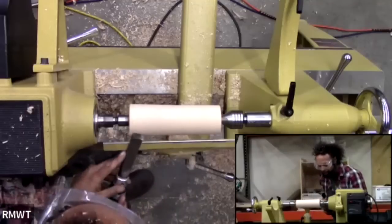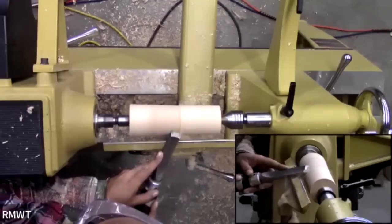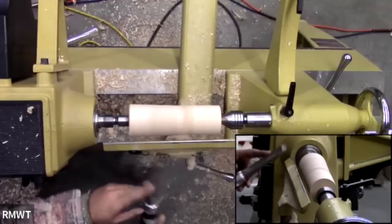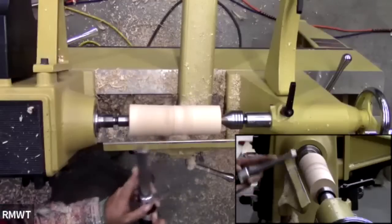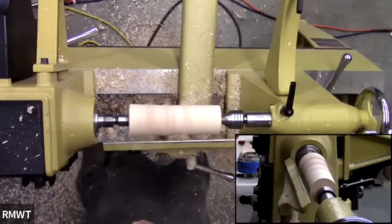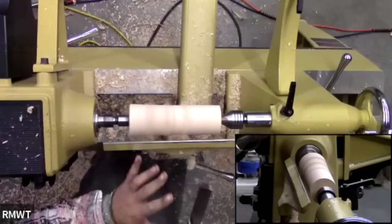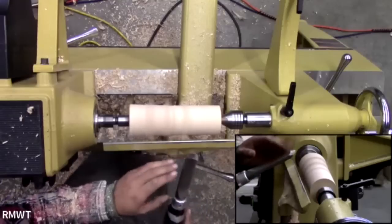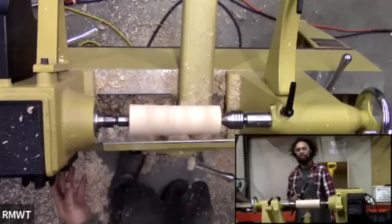So, anyways, lead with the bevel, raise the handle, and that's a really nice cut right there. That's a good shear cut. Shear slice. If the unsupported edge drifts away from that cut like this, that's a catch, right? Let's make another one. Beautiful cut. I feel good. It's going great. And there's another one. Let's do another one. Wow, this is what I call fine detail. No, it's not. It's not fine detail. But let's do one more. I don't think I could do another one without cringing and getting over that it's not. To me, it's funny for a minute and then I get over it and I got to fix it. All right, let's do one more, four catches. And ooh, so let's see our wonderful results, shall we? Okay.